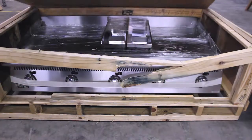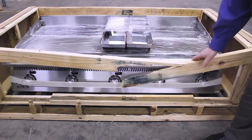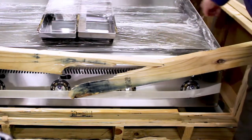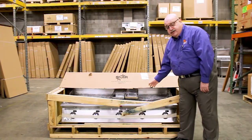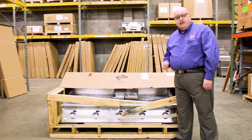Open it up. You'll notice that, concealed by the box, there's a break in the frame here. This is something you need to check. Now look at the unit — make sure there's no cosmetic damage, and no damage that will stop it from working. This is an acceptable delivery. There is no damage here. Make sure you note this on your bill of lading before that driver leaves.